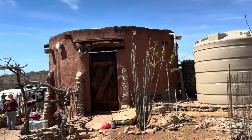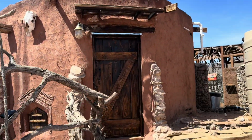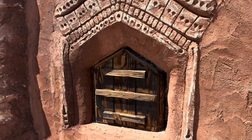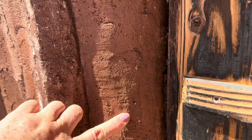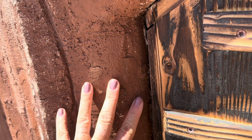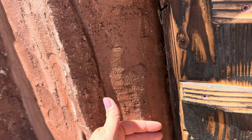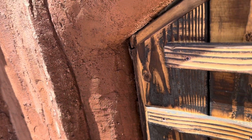And this plaster is nice. He's got his first coat of wash on here. Carrie and Doug have worked really hard to do that. He's done some neat artistic work. We've not had a whole ton of rain lately, but you can see in the plaster he was showing me where it'll crack sometimes. But once you re-wet it, because it is lime based, it will self-heal, and you can put a new fresh coat of lime wash, which is basically lime paint, over that, and it'll seal that crack, and you can manage that.